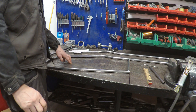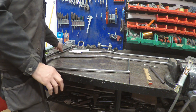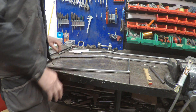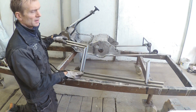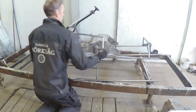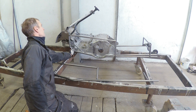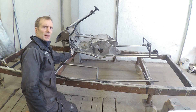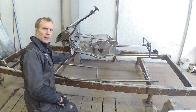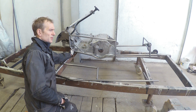I measured the aluminum chassis in the front and now I've made some tube pieces so I can get all the mounting points. I've now done both sides of this tubular frame. As you can see, it fits quite well into the original frame chassis. Now I will tack it to my jig and try to measure it so I get everything straight and in the correct position.